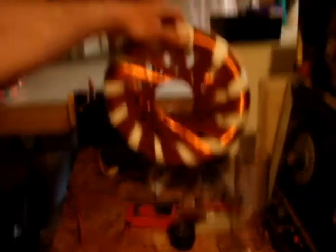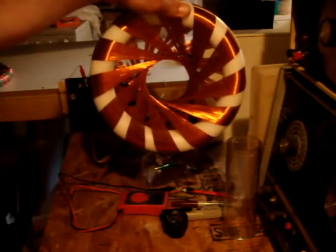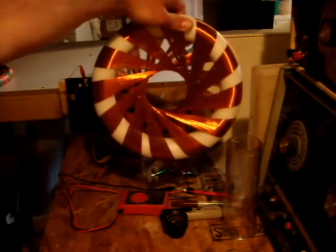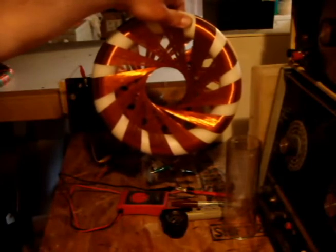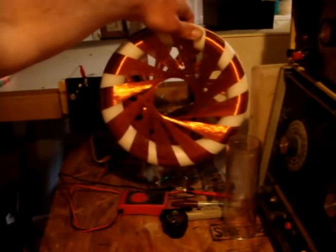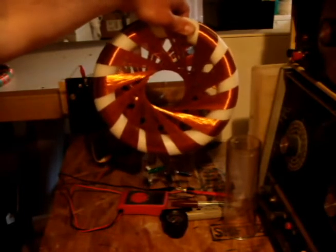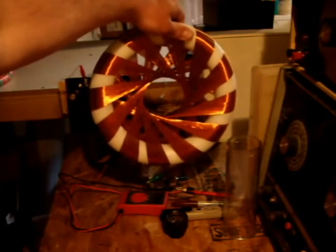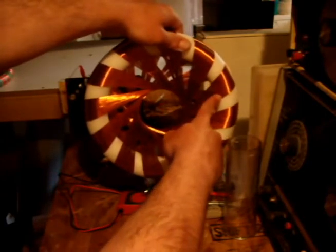This is my other coil. It was built with 26-gauge wire, has 48 iterations per coil, built on a 10-inch form also, and provides substantially less resistance. I am able to get enough current through this coil with my 12-volt power supply to experiment with, though it is still under an amp. Once I can afford to, I will purchase a better power supply. I plan to coat the coils with epoxy so that they may hold the form, then remove the polystyrene so that I can explore the coil in three dimensions. As you can see, the shear line is intact on it.